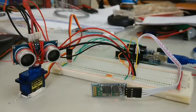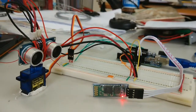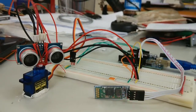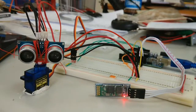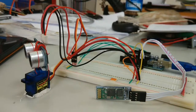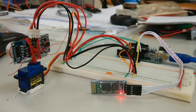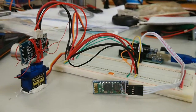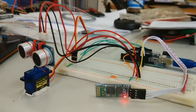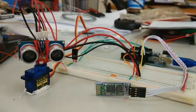It's a total disaster. So over on some of the RC forums, I'll try and find a link for this, I found a different sketch that's a little bit simpler. You just kind of set up everything you want in the sketch itself. You know what name you want it to have, what baud rate, etc. And it just sends that all over at once. And I eventually got that to work. And at 57,600 baud, it is behaving much, much, much better.